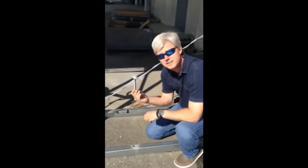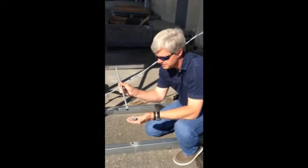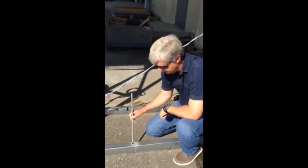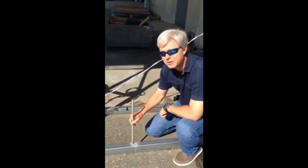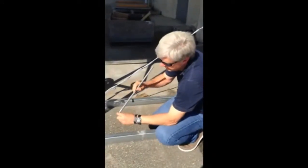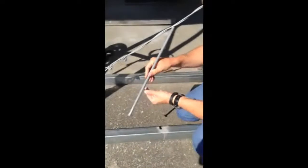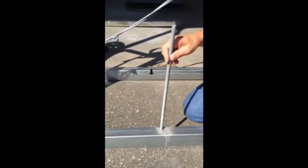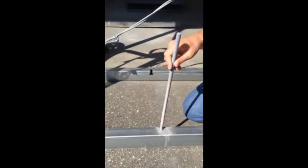To insert these 18-inch rods into the base rail, it's difficult to set them in on any angle other than straight into the groove. If you notice that the base of the bolt has a square groove, if that's turned ever so slightly, it will not insert into the slot. The slot is pre-cut accurately enough that you must align the head of the bolt into the groove. That keeps this panel from ever working its way out in winds.